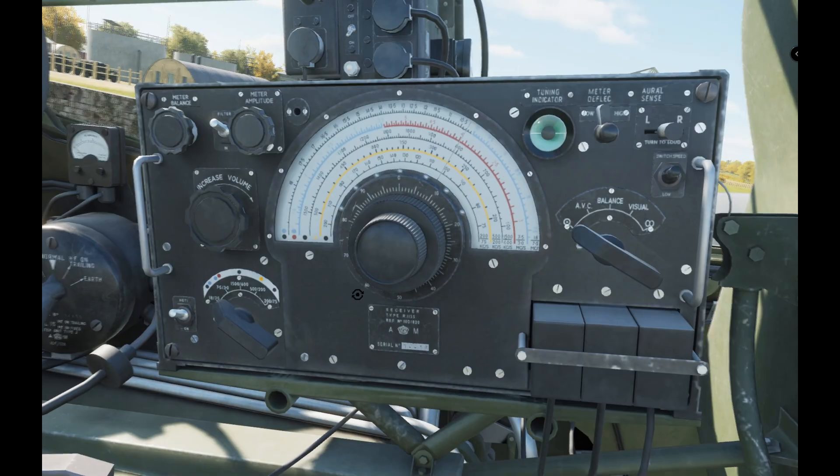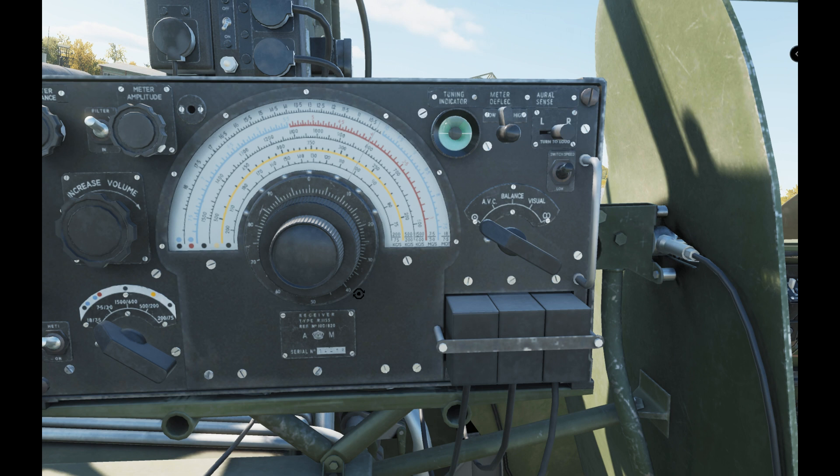So the radio's turned on. How do we tune it in? I've set up a beacon just off to our right on 700 kilohertz. If you look here, you can see 700 is on the black band — but it's not plain black, it's black and blue. On the selector you can see: black and blue, then red and blue, then pure black. So we want black and blue. Now all we need to do is use this turning dial — when it's cold this will be all the way down — so we sweep it around towards 700 kilohertz.